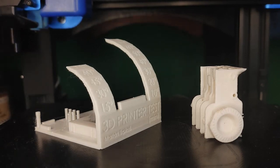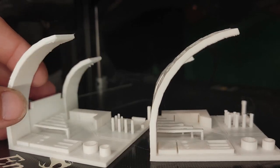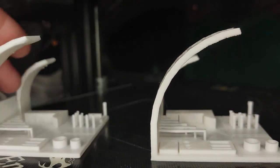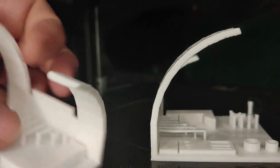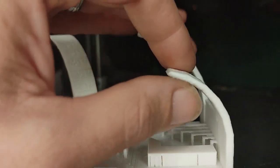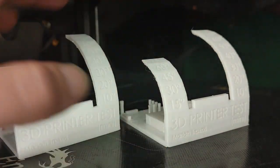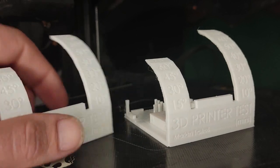Let's compare these two overhang tests and see how they both came out. The overhangs printed pretty nicely on both machines — again, on the left is the Ender 3. Flipping these to the back, we're looking for where it starts to deviate underneath where it's unable to support its own weight. This model looks like it's done a really good job. There's a little looseness at the 15-degree change, right around the steepest angle between 60 and 75 degrees. The variation continues down to 45 degrees. The Ender 3 is good up to about 60 degrees, and it prints a little bit better at that 45-degree angle than the Genius did.